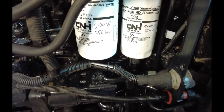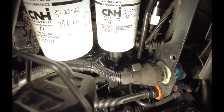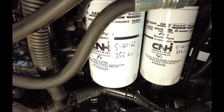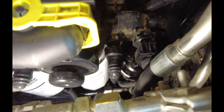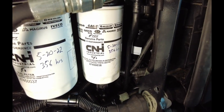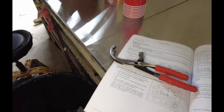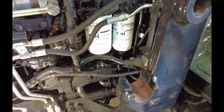You're going to want to unclip the electric wire on the bottom of that — the sensor wire. You're also going to want to pull that out and unscrew that sensor so that all that fuel can go ahead and drain out. Once you do that, that guy comes off pretty good. The front one, the main primary filter, is going to be full of fuel when you pull it off — so you're going to make a little bit of a mess. You also want to make sure you take this clip off right here — that allows this whole unit to pivot out, which allows you to get in and get to the engine oil filter on the back side. I did go through a couple of different filter wrenches. This little Milwaukee fuel filter wrench does a nice job. To get back in to that engine oil filter, I did have to use that Milwaukee wrench all the way back in there.